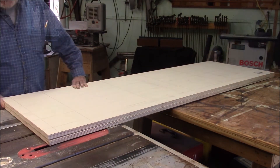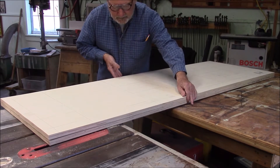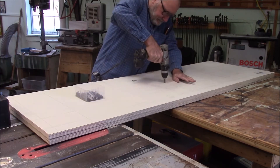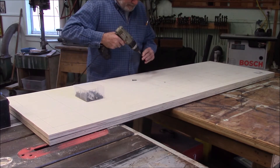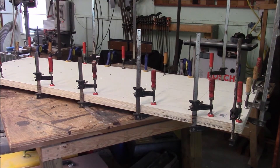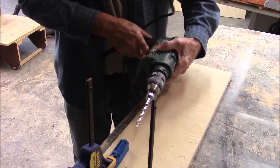Now I'm going to stick them together. The screws will both form a mechanical bond and also help pull the pieces together. I'm thinking two sheets of three-quarter-inch plywood glued together — it's about the strongest thing ever constructed. I got the glue up on the base finished. I thought the clamps were totally unnecessary so I doubled up on them. Now let's get to holding the sides to the top and bottom using Kreg screws and pocket holes.